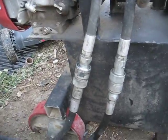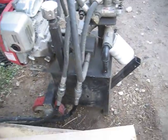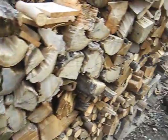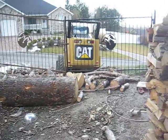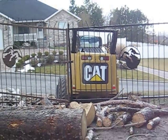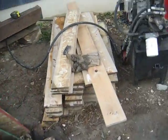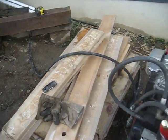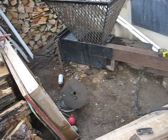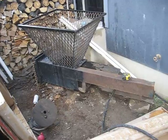For hydraulic lines, I have some quick couplers here that go to my power unit. The nice thing about having quick couplers is if you have tractors or what not, you can basically pull a skid steer right up to it. If you have a quick coupler attachment, plug it in and you can run the hydraulics off of that — or even farm tractors with quick couplers on the front.